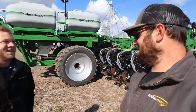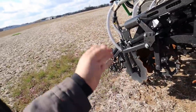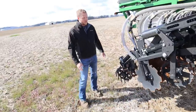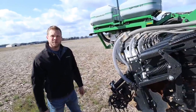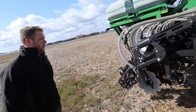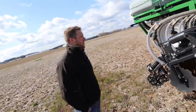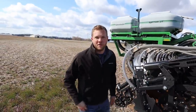The scales are really nice - I wish planters had that. Looking at the shank, we've got an opener, a row cleaner, gauge wheel, shank, and closing coulters - they just grab some dirt, pack it back around, berm it up, and firm it with closing wheels or crow foot closing wheels. Everything is fully adjustable - spring pressure, depth, angle - so you can adjust it just the way you want. It's a pretty heavy shank. It is the same row unit whether it's on the three-point unit or the pull-type unit. We hit some really big rocks last year. It's an auto-reset, so it protects the unit, and there's also a shear bolt in case you find a heck of a boulder it can't trip over.